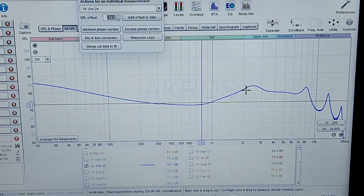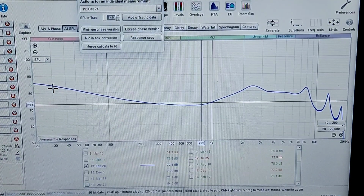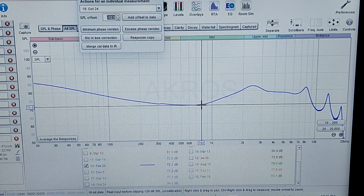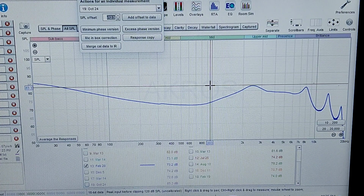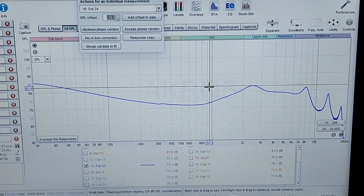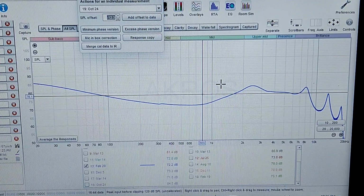A nice slow progressive pinna gain, peaking at about 2.5 like I mentioned, and then that drop off which is nice and relaxed, peak at 8, and then some extension which doesn't really exist. Sub bass focused, it's by no means a sub bass monster. No, forget it, it isn't. The pinna gain is 72 roughly to 83, so roughly 11 dBs. It's just above the ideal, let's say 10 dB barrier. But again, what the graph says and what you listen to is not exactly 100%, and it's basically down to the fact that it's just a 6mm driver.